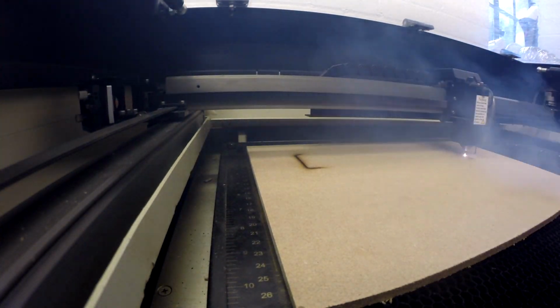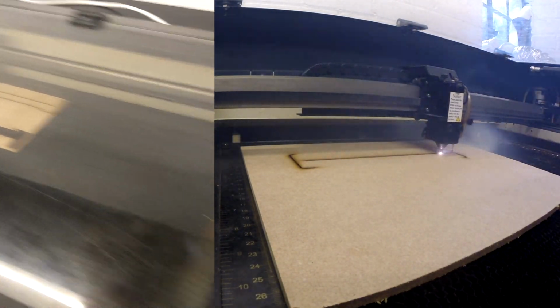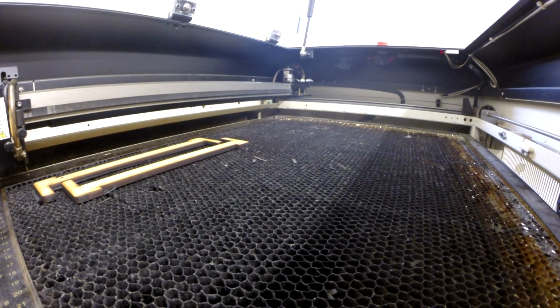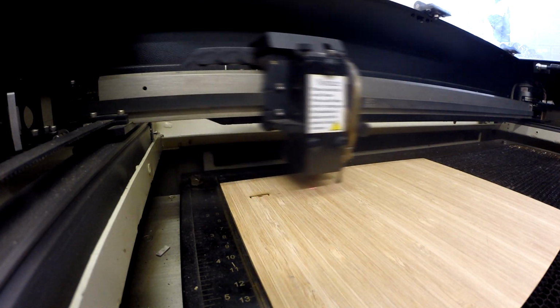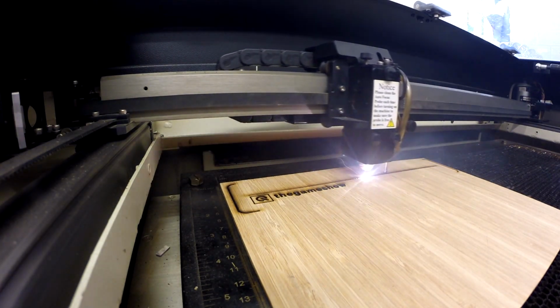I definitely made the right choice going with laser cutting over CNCing, because that took me 1 minute 30 to do a quarter of what I needed to do. I started out cutting the ply, good old faithful plywood. When moving on to MDF, this makes a hell of a lot of smoke and it's got a bit of a stink to it, so you want to make sure that there is ventilation, and you've probably let other people who are working around you know that you're doing this.